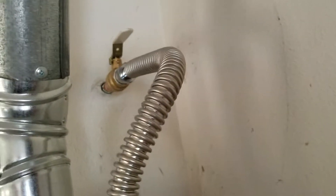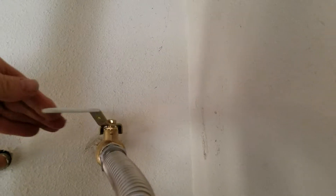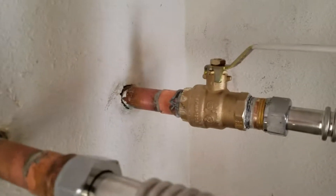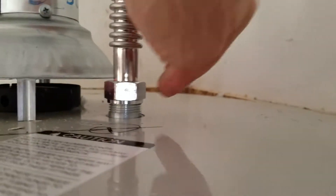Up here on top, we went ahead and replaced the cold water valve — that's not in the contract, but we'll put it in anyway at no extra charge. It's a three-quarter Watts full-port ball valve, quarter-turn off, quarter-turn on. We cut back the existing copper and soldered on some adapters. On the hot side: a Watts ball valve, three-quarter brass nipple. Three-quarter by 18-inch Falcon stainless steel connector to the cold side. We checked it to make sure we didn't have any water — looks dry.